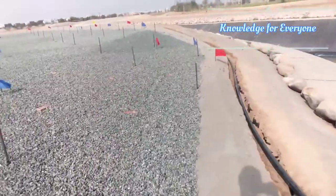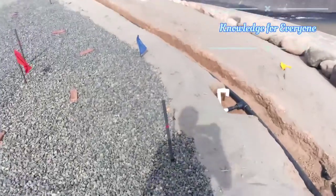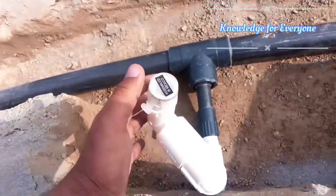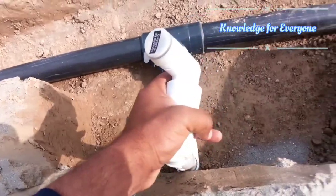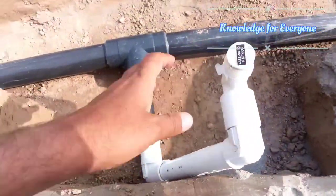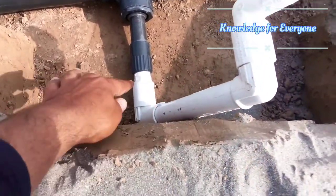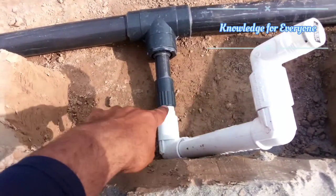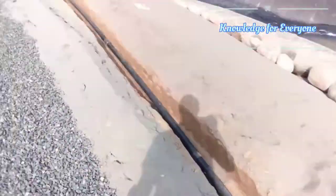The pipe is going in a curve a bit — there is no problem, it can take that much curve. Here we have a swing assembly, as you can see. It can be adjusted anywhere. This is an ACME thread and that is BSP. This is a 2-by-1-inch T with a 1-inch female, and the swing assembly is male — so male is connected to female — then it goes to a 2-inch diameter pipe straight.